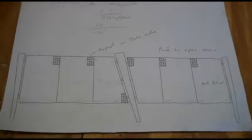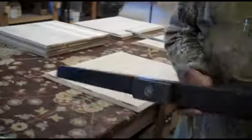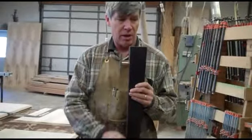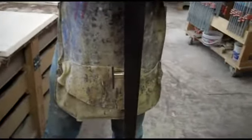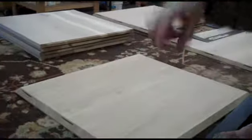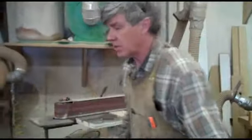I've got most of these components made. The carcasses aren't yet put together, but I have the pieces. That's the drawing — you can see a push plate at the bottom on this particular door. The legs that you saw in the model: there's a bronze piece that's threaded into this leg, and all these dark components are made from wenge. So there's a quarter-inch piece of bronze and a half-inch stainless steel flathead bolt that pulls that together. This piece of bronze will be on the inside of the case, so that when these go together, the bronze will act as the mounting piece to attach the leg.